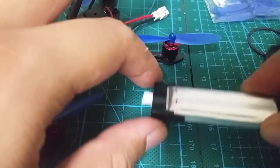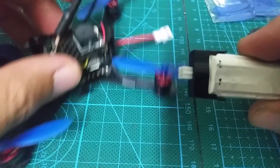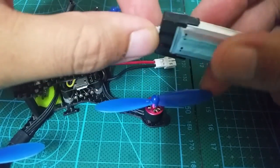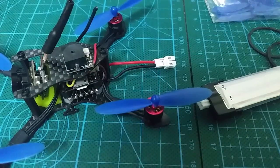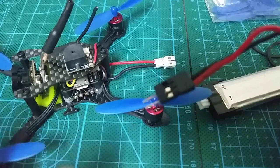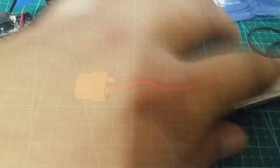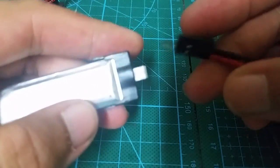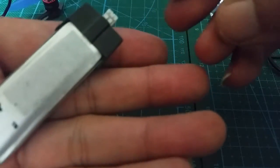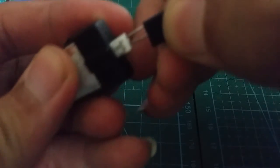This is the battery that comes with the quad. Unfortunately the connector it uses kind of makes this battery proprietary — you can't really use other batteries unless you modify the connector. Plus most people, even hobbyists, probably don't have a charging cable that matches this connector; it's just not very common. I didn't have one either, so I decided to fab one up real quick. All I did was use the first two pins and connect it to an XT60. For sure this is not the safest way — you definitely need to be cautious when plugging in to charge, because you can very easily plug it in backwards. I've labeled my battery as an added precaution, but it always pays to double check.